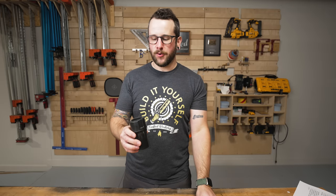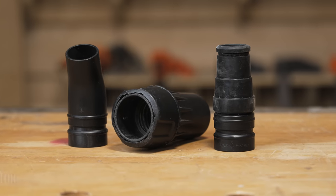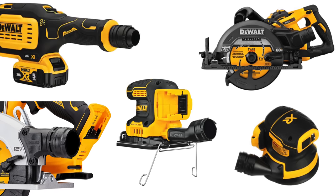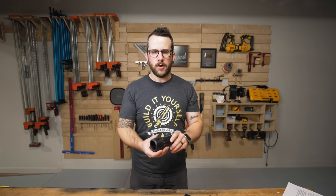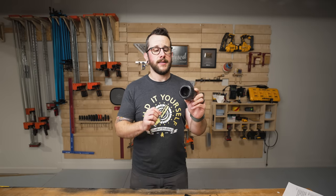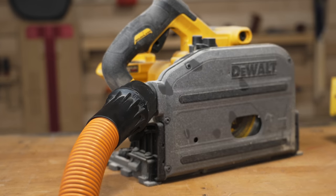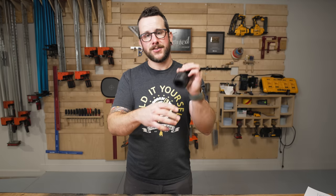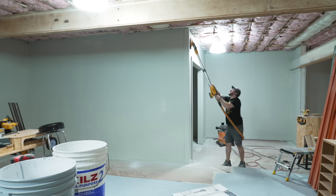Next up in shop safety is this really cool dust collection system from DeWalt — this is not a sponsored DeWalt video, I just happen to have a lot of their stuff. When I first started using this system I actually really hated it because I didn't understand it. If you've bought any kind of more recent DeWalt tools — my FlexVolt miter saw, some circular saws, my drywall sander — they all have this weird dust port that didn't work with an inch-and-a-quarter hose or my Festool hose. It turns out DeWalt makes a custom adapter with a twist-lock functionality that mechanically locks onto whatever dust port you attach it to. One of the most frustrating things when trying to be good with dust collection is having the hose constantly fall off — with this mechanical connection, it will not come off. You can literally pull the shop vac around by the connector.